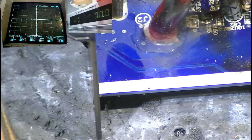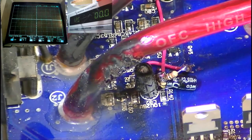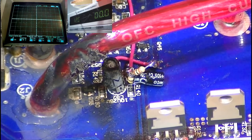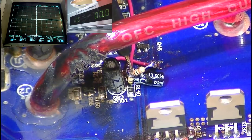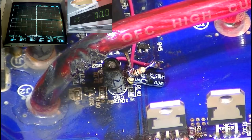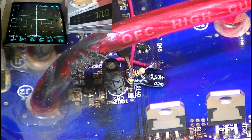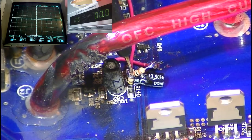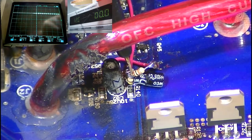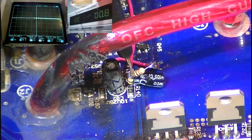Now, what does that look like on the mod circuit that we've made? Let's go over here. So remember, pin number 4 of the TL494 needs to have voltage that sinks down on it. So let's apply the remote, and I'm going to probe essentially what we're sending to pin 4 of the TL494. Amplifier comes on. Let's just give that a bit more voltage. So the amplifier turns on, voltage rises to about 3.4.